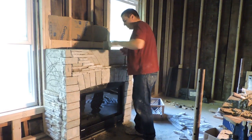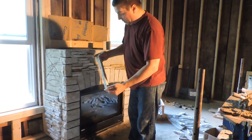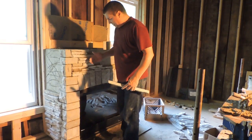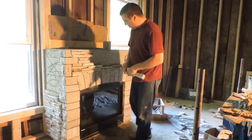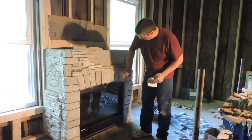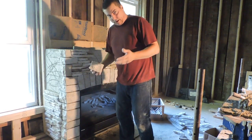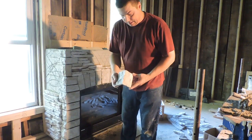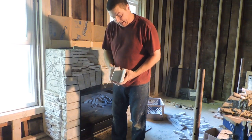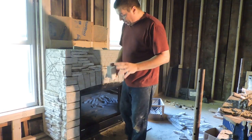What this consists of mainly is a Door County flagstone edge which has been cut off the stone anywhere from three quarters to about an inch and a half thick, because I want to vary the depth of the stone so it has a little bit more detail to it. This is the same type of stone but it's a dressed limestone. I start with a large Door County limestone and dress it into corners, then once the chisel work is done I take it onto a 14-inch brick saw and gut it out so it's thin, which cuts way down on the weight.